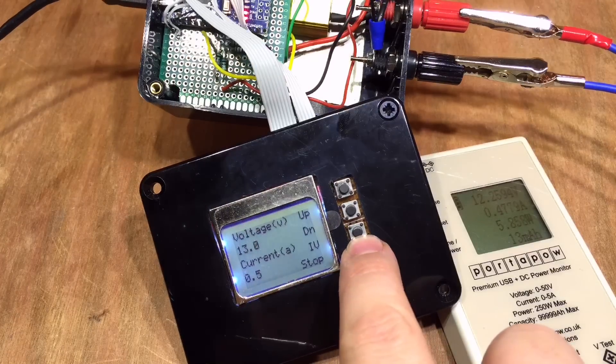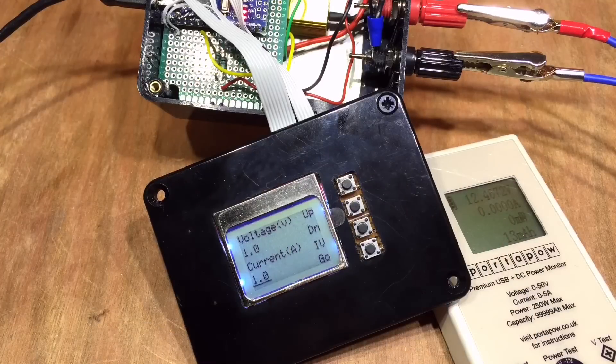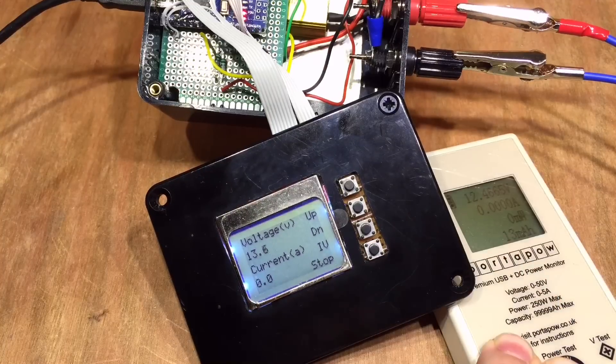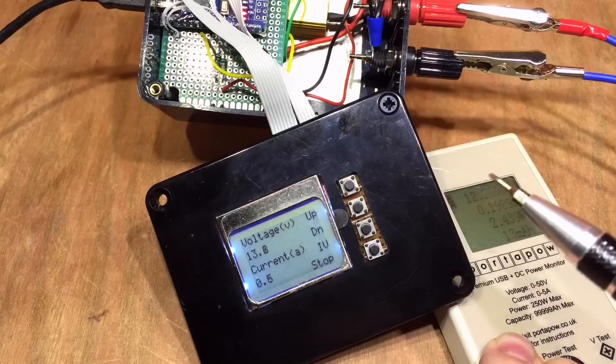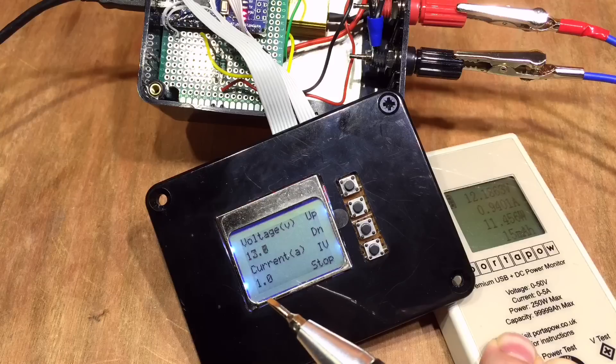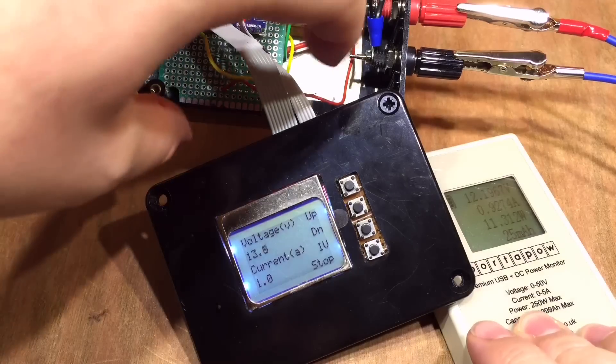I'm really pleased that's working really well. If I stop that now — should we try increasing it? I don't want to go over an amp because the power supply I'm using doesn't have current limiting, and it'll probably get warm. Let's give it a go. It takes a little time to creep up, and then look — 950 milliamps. There's obviously some adjustment to do in the code and the maths, but actually I'm quite impressed — it is fairly constant.